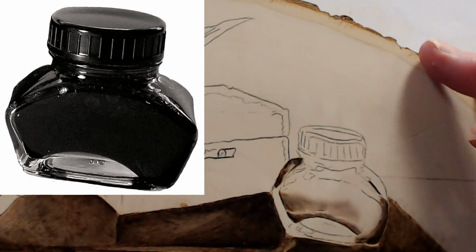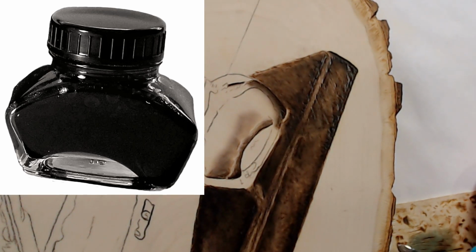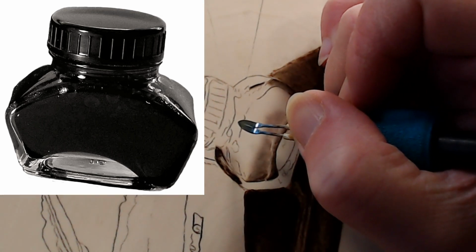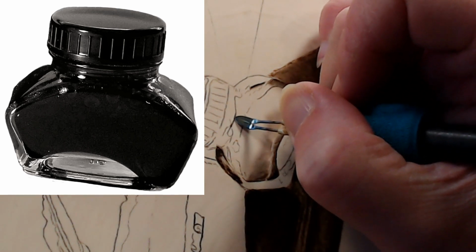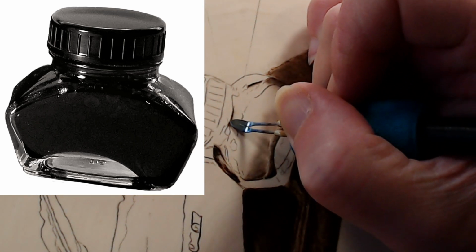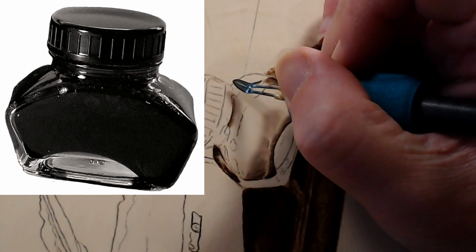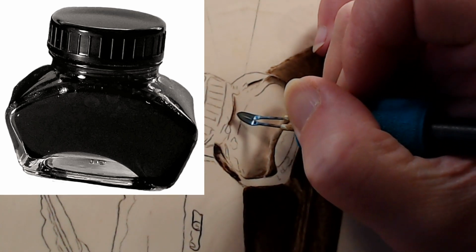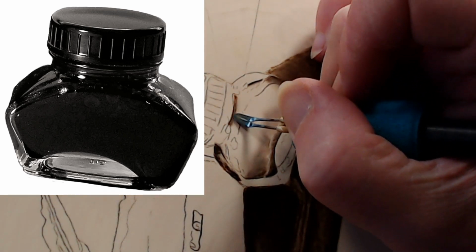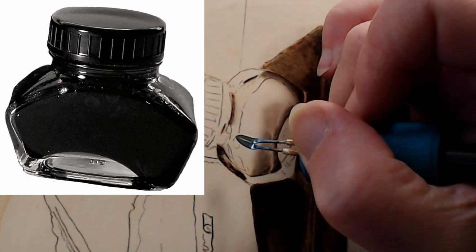Nope. Alright, so oops, there's my test wood. Also, when I'm hitting the test wood, it kind of cools the tip down for just a second, enough for me to get onto the board, blow, and make contact. Pull it down, blow a little bit if it gets too dark. In blowing, I'm just taking the edge off the heat. Makes it easier when I set back down.